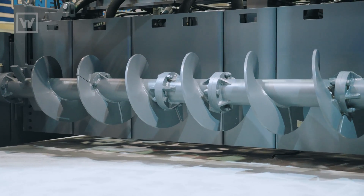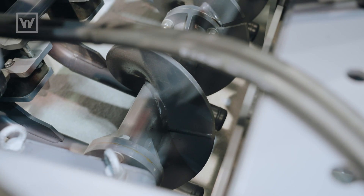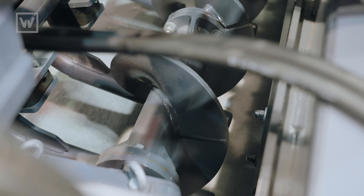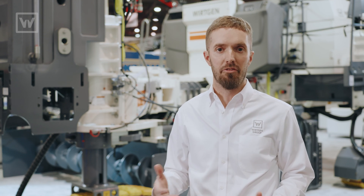You have a mold that has an auger strike-off in front of your strike-off with another grout box auger, your vibration, and your tamper bar. That is very unique to the Wirtgen SP25 and will allow you to pave more effectively and efficiently moving forward.